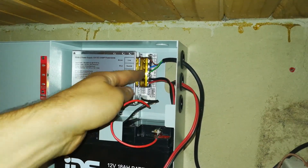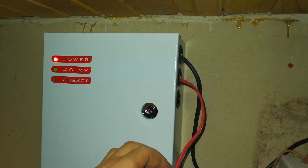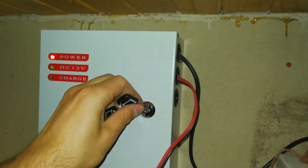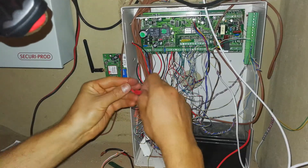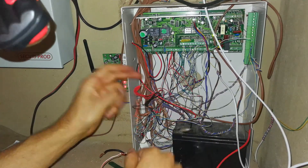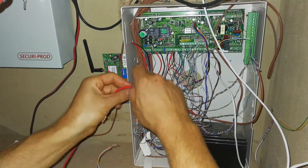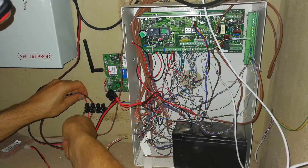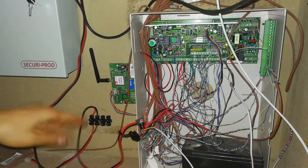There's the wiring — the mains supply and then the 12 volt output. I'm closing that up now. The unit is fine — close it, and if you want you can lock it. These are all the sensor wire positives. I've lengthened the lead to have more space to attach the fly lead. There's the fly lead — I'm wiring it in here rather than directly to the panel, because I'm going to keep adding things to this panel, so I have this terminal block here for future growth.